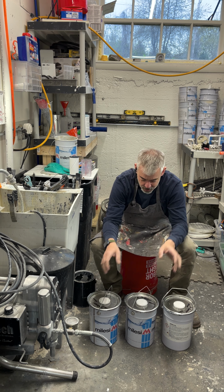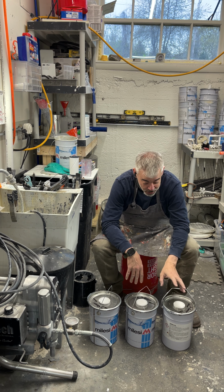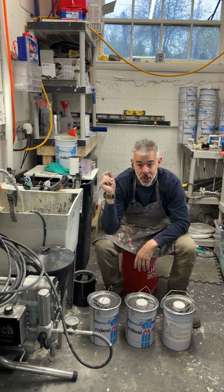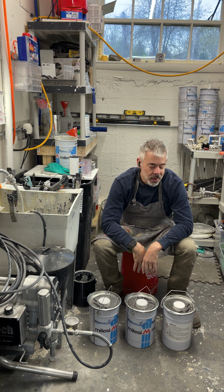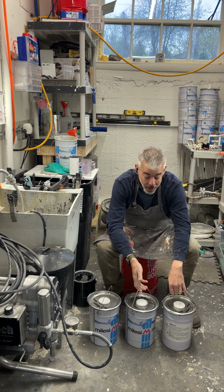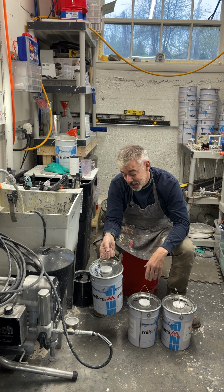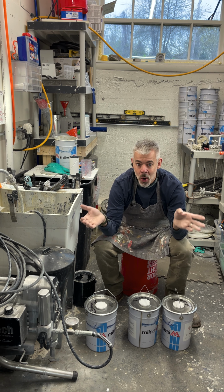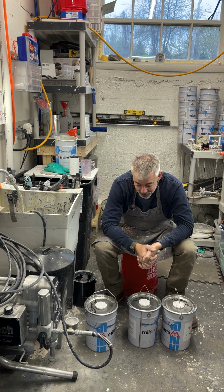Now, if you mix enough paint or you buy enough paint, eventually, what's going to happen is you'll get 2 gallons that are consistent with St. George White, and the third one might get an extra drop of red, or an extra drop of black, or less than an extra drop of black. It'll stick in the machine, and you'll have no way of knowing that until you get to the position where you've used 2 gallons to paint the fronts and the backs of the doors. And then you go to paint the bases of your cabinets and you use that third gallon. And when you bring the doors to the job, the doors don't match the base. And believe it or not, it has happened to me.